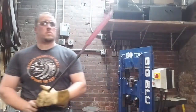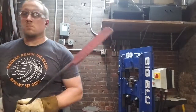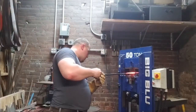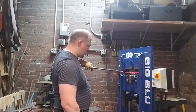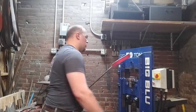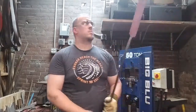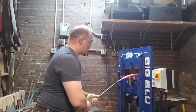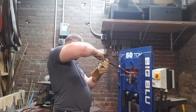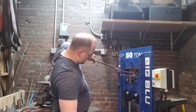Modern knife smithing techniques have completely eliminated a lot of these stresses from the process, but that's not the objective. You can't get historic results without at least a few historic techniques. So we're going to be drawing out gently with a gently curved die. You might say, well, why not just use two flat dies?